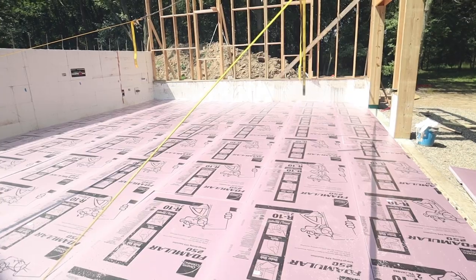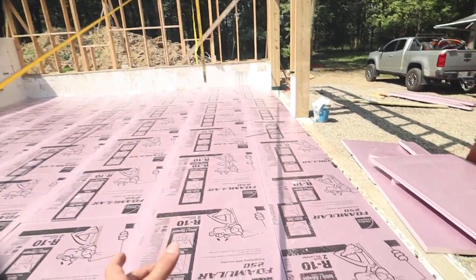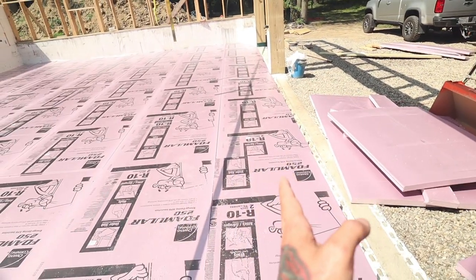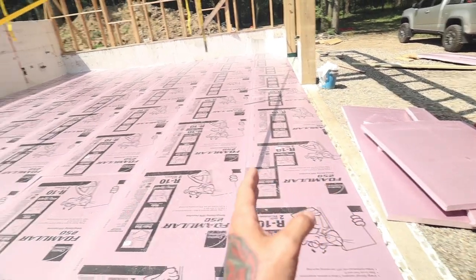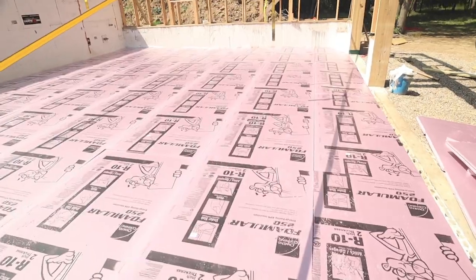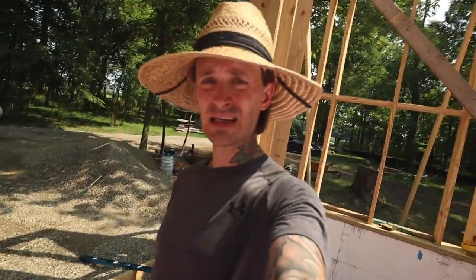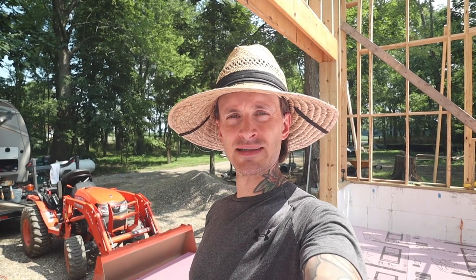R18.4, I don't think we need to go ahead and put these PEX basically 12 inches on center. I'll probably start out at the outside edges and get them close so that stays warm. But the further I get in, like in the center here, that doesn't have to be super warm, just really the edges of everything. So we'll try to be conservative and see what type of 300-foot runs that we can put down, because I've never done this before. But I've got a whole box of clips that I'll show you, and a tool to make this super easy to put them down. So let's go ahead and get started with that project now.